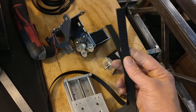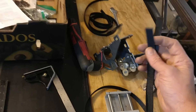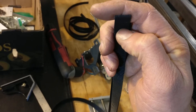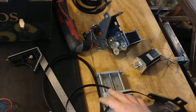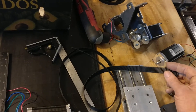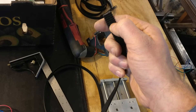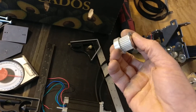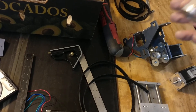The timing belt kit gave me five meters of belt and five pulleys for $50. The belt came as one piece but I've pre-cut it to fit roughly what the machine will take — cutting it does require a hacksaw since there are steel cords running through the belt, which is a very good thing because it minimizes stretch as the gantry zips back and forth. The belt is 15 millimeters wide, so it's generally pretty stout and I'm very pleased with the build quality. The pitch from tooth to tooth is three millimeters and the pulleys have 24 teeth, which means in every revolution you get a little bit less than three inches. I went over all the math for those calculations in the LinuxCNC software setup video.